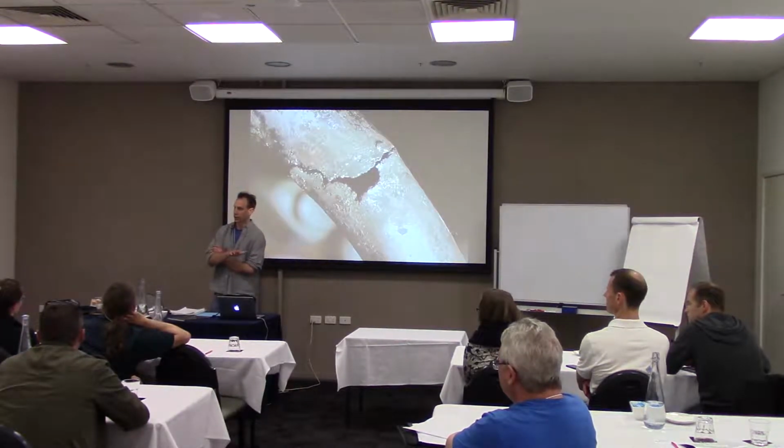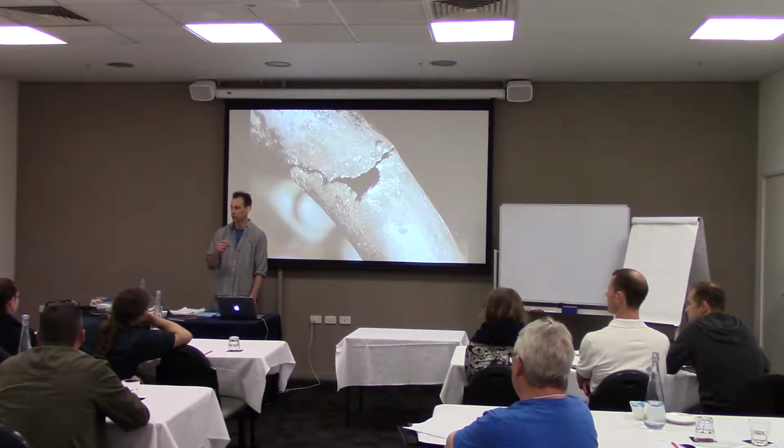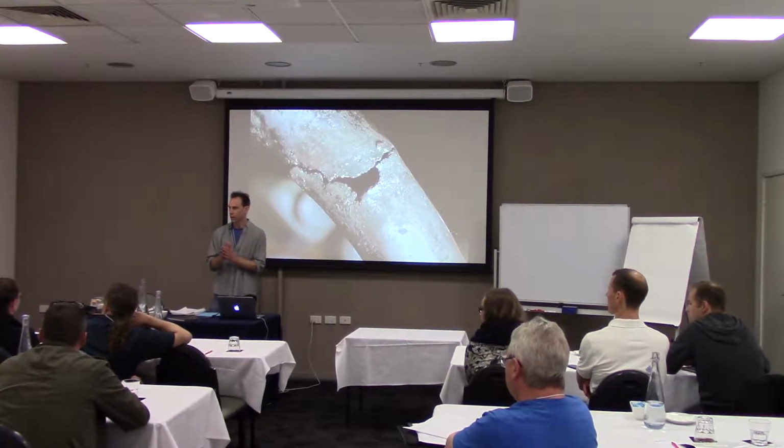I run mine really low, because what I do find is if I run it, I've got the big 90-gallon tank, and I would run it about 50%. I was trying to be kind of in the middle, and I was still finding that on bare brass valves it lifts the grain. I'll have a little bit of grain lift on it, and you get little sharp edges, and you've got to go back and burnish that. It doesn't take much to strip the plate off a bar. No, you've got to be really careful. So now I run it down to 20, and that seems all right. I've been okay with that.